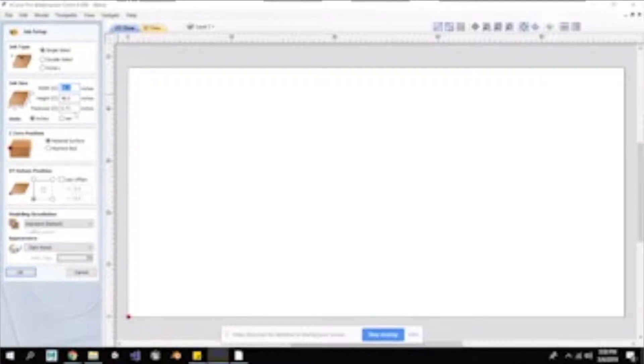So we want to make sure those are set correctly before moving forward. If your material is any smaller than that, just adjust it to whatever size your material is. Your thickness is also really important. Three-quarter inch plywood is never actually three-quarter inches, so we need to grab a pair of calipers and measure at a couple of locations. What I measured today is material that is 0.72 inches in thickness. I'm working in inches, though you could work in millimeters.